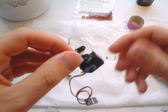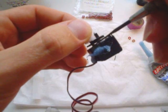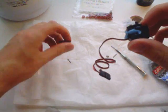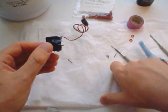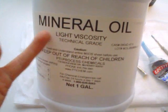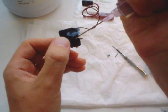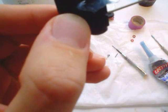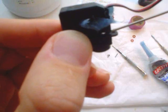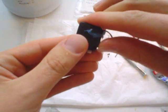With the top, there are two places water can get in: this motor output shaft here where water can possibly get in, and this little shaft output here where the pot comes out. To waterproof that, put the top back on — not entirely though, you need a little bit of crack left. Then get some mineral oil. This is mineral oil from McMaster.com — really cheap and comes in large quantities. I filled this syringe up with mineral oil and inject the mineral oil into the servo. This mineral oil will keep water out and keep everything protected. Then close it up real tight like that.